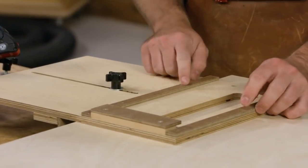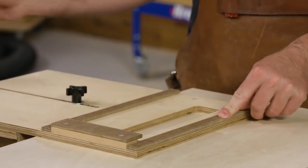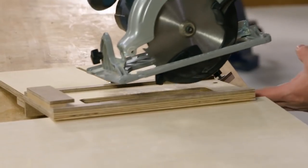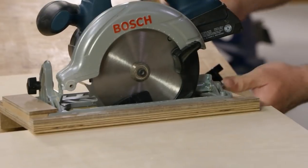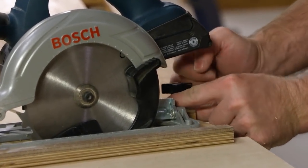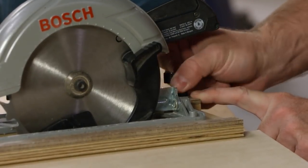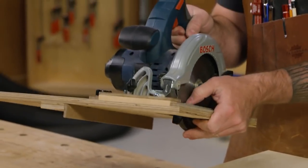To hold your saw, there are hardboard cleats on the front and sides. That allows you to clip your saw in place — it slides under there and locks it down. Then there's an additional cleat that screws into the backside into a T-nut. After tightening that down, the saw is locked in place on the guide.